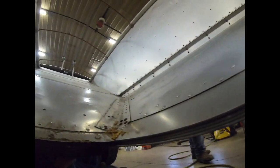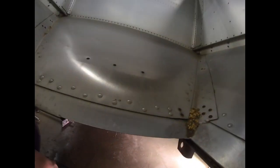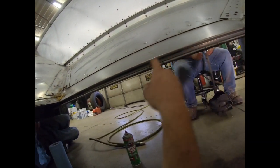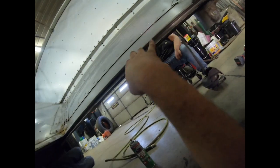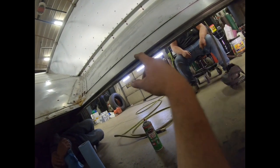Now we're inside the hopper — if you've never seen the inside of one of these hopper bottoms, it's just some sloped floors, rivets, and aluminum. What we need to do now is clean all these tracks out really good where the poly has to slide for the door to open and close. We're going to squirt some brake cleaner in here, take a rag and wipe it out real good, and probably take a wire wheel and a die grinder to make sure everything's out of there so it opens and closes nicely.